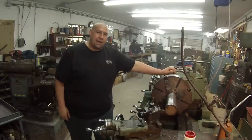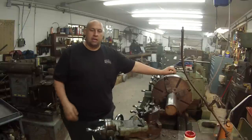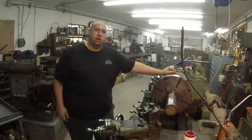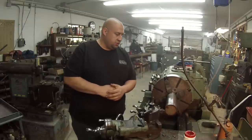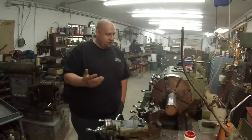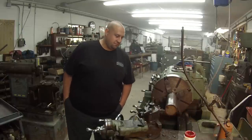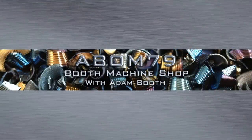I've got an idea to come back at a later time and play with the tail stock — that's a whole other story because it does have some wear and actually sits slightly low off center. We've already done some work on it in the past, but that'll be for another video. So that's our Monarch test cuts — we're within a tenth of a thousandth on a 10-inch span. I think we're good to go. Hope you enjoyed it, and we'll see you on the next video.